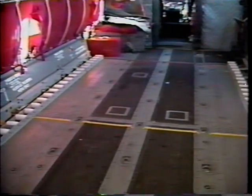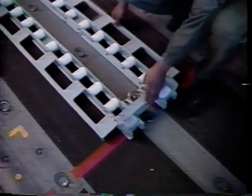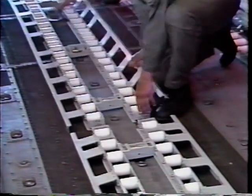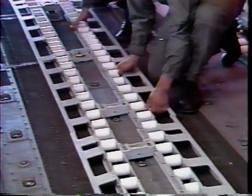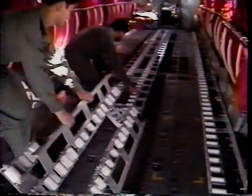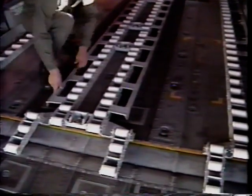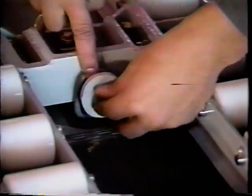To install the inboard roller guides, position the forward inboard guide roller assembly on butt line 0.000 so that the forward end is aligned at station 157. When installing all inboard roller guides, ensure that no 5k tie-down ring is blocked. Position the forward hatch inboard roller assembly on butt line 0.000 directly behind the forward guide roller assembly. Position the center inboard guide roller assembly directly behind the forward hatch inboard guide roller assembly, and position the aft inboard guide roller assembly directly behind the center inboard guide roller assembly. Connect tie-down assemblies to the 5k tie-down rings on the helicopter floor using centerline ring plug assemblies.